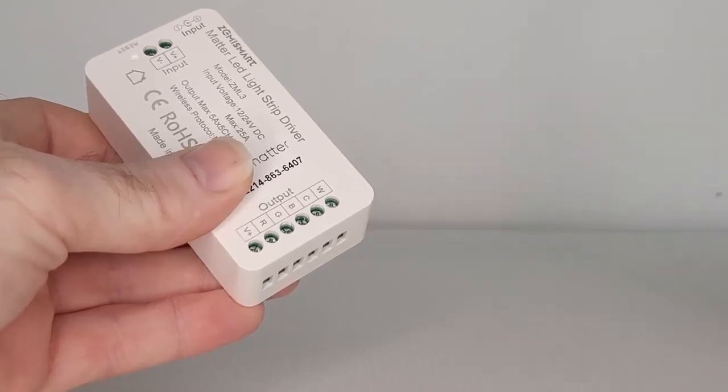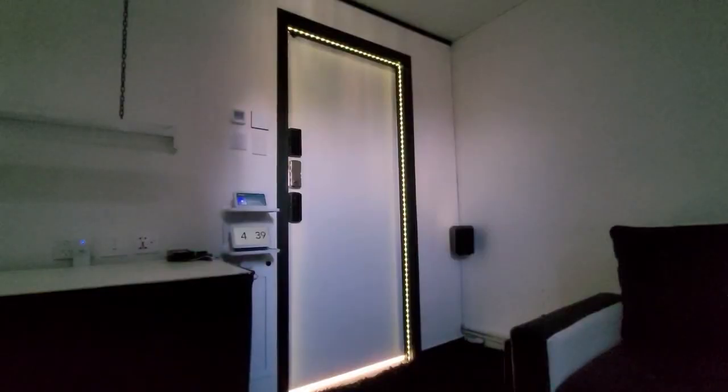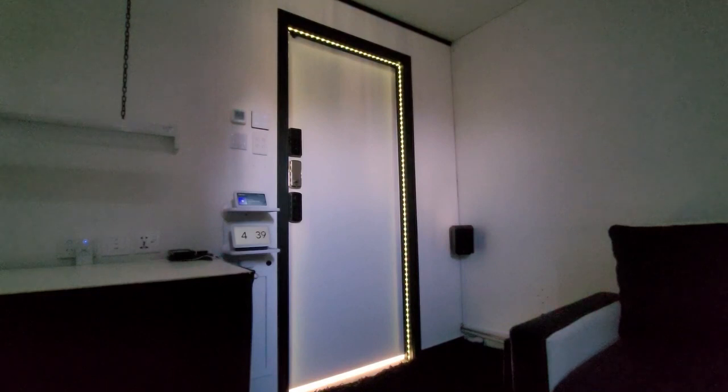Not only does this device support both the 4-pin and the 6-pin LED strips, but another great feature is how the brightness of the individual colours can be individually controlled. I can change the colour to red and set the brightness to 100%, then change it to green at 40%, and continue using other colours getting dimmer every 5 seconds.